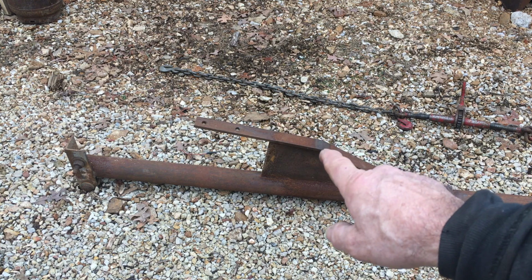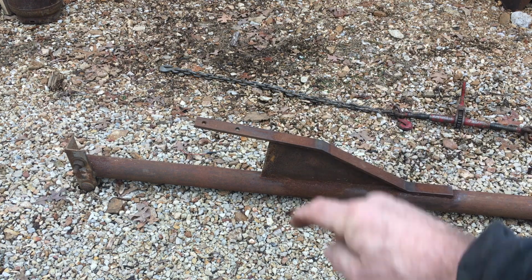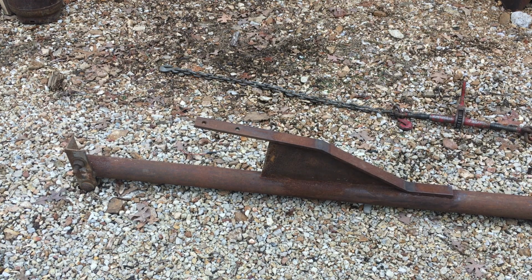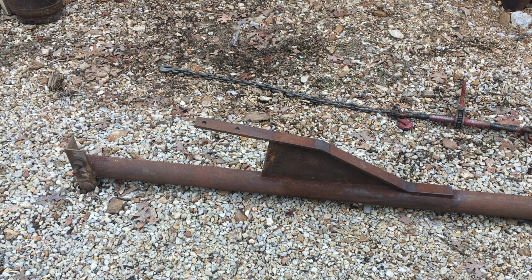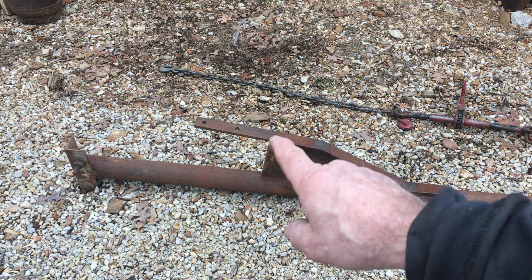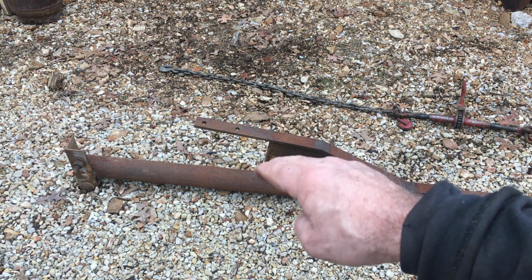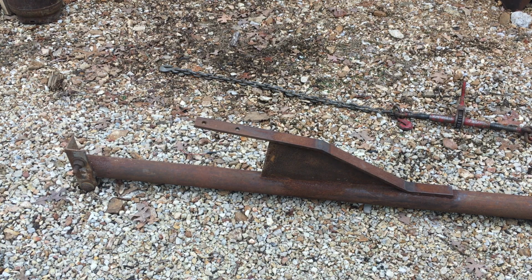I got a little over 3/4 inch holes bored in there, and then right through the center of the top of the bucket where I've got a big plate. It's a plate of 1/2 inch steel where I put a center lifting eye, or lifting hook. Those align with 2 holes that I drilled and tapped 3/4 threads to, and so you get 4 3/4 inch coarse thread bolts that attach this to the top of the bucket and to the webbing on the inside of the bucket. So it's really fairly stable.